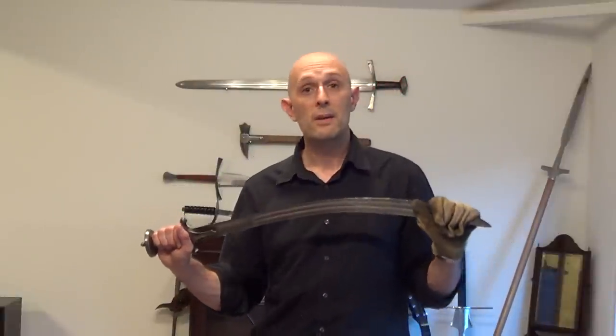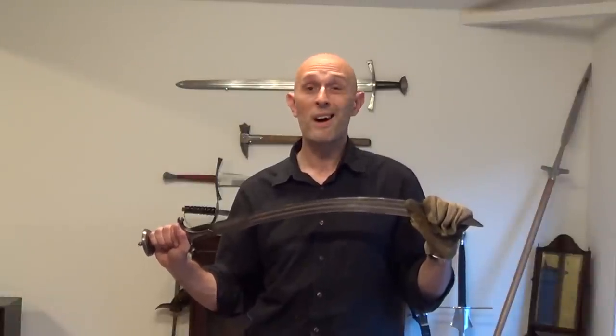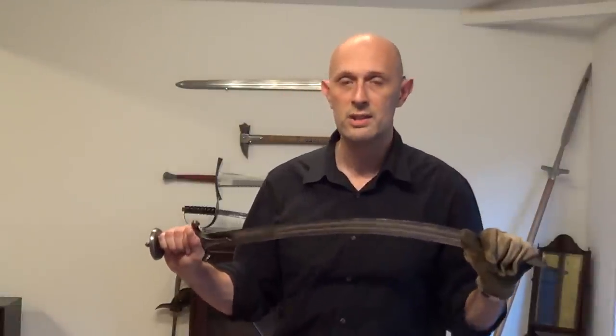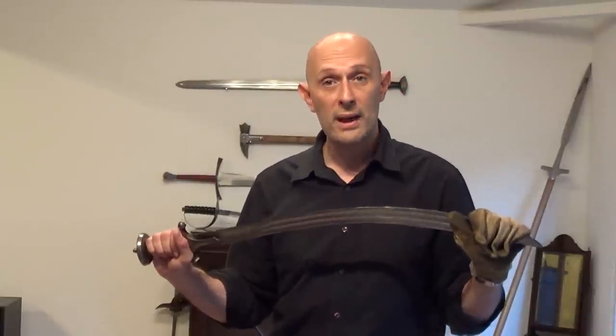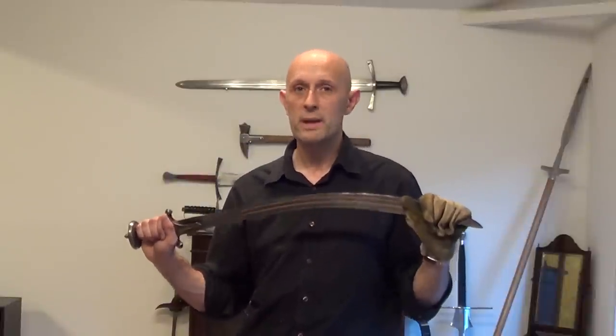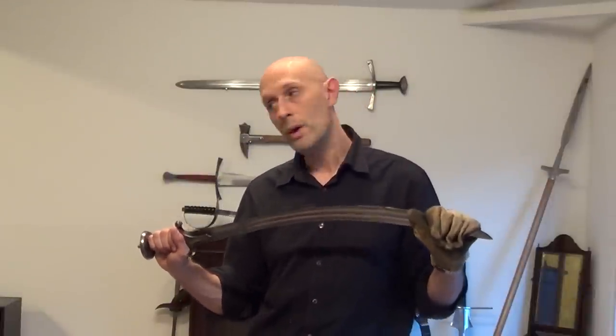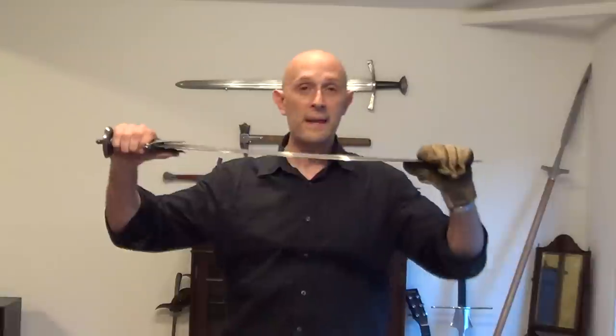The fact of the matter is that the way the katana blade is made provides a very hard edge — that's the advantage. It's a very hard edge and a stiff blade. It's a thick blade because it's not made as a spring. You have to make the blade thick because it won't flex like a European sword. If you bend it, it will stay bent.